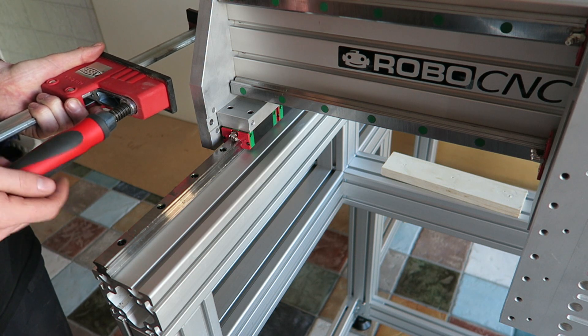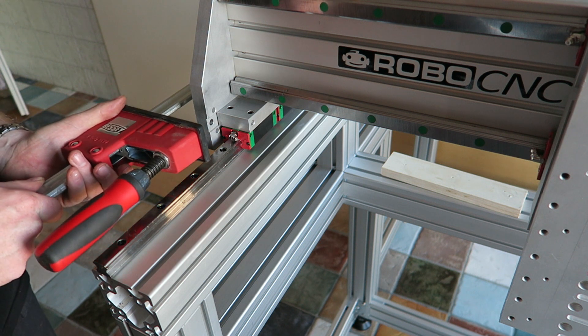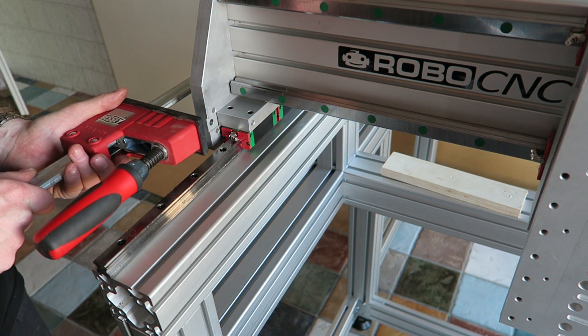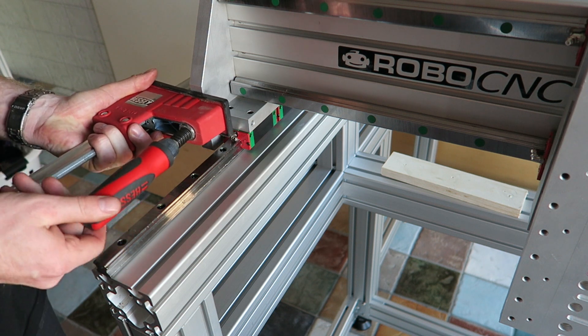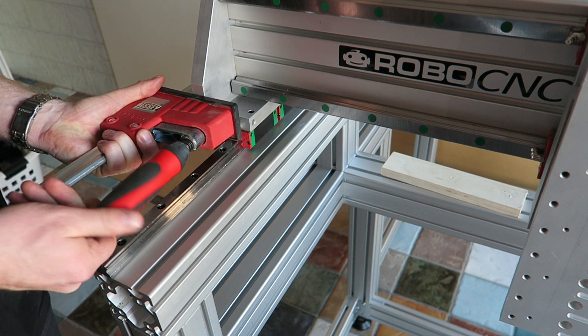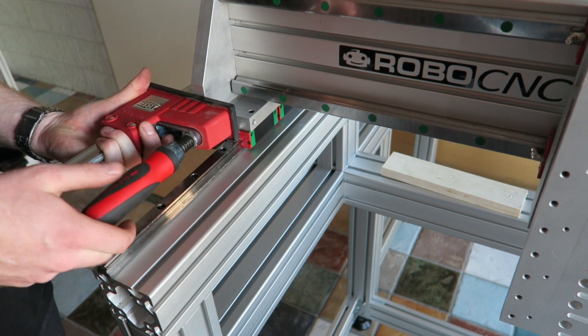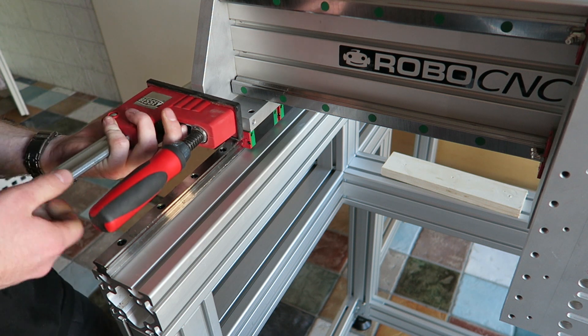So I'm using a woodworking clamp — I clamp these bearing blocks and the aluminum piece inside, clamp it, shift it inside. It should slide in but everything is real tight toleranced so I needed a little extra hand to slide it in.